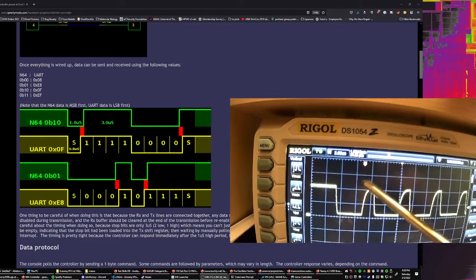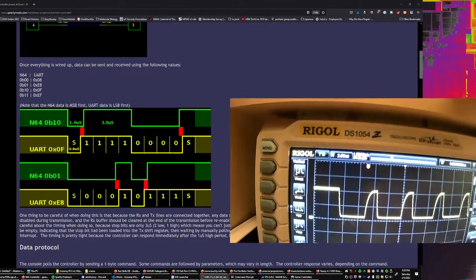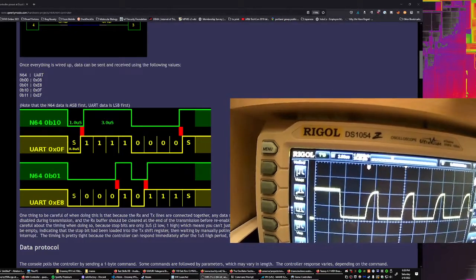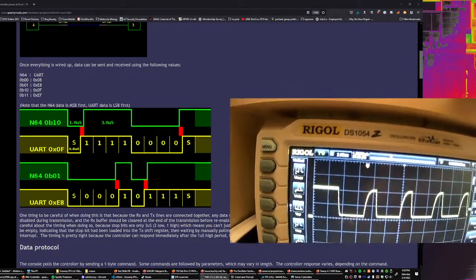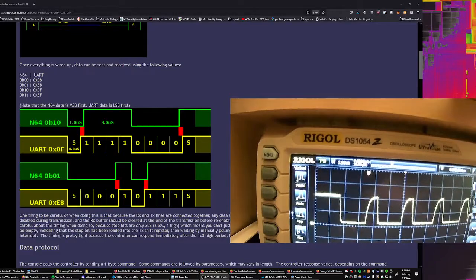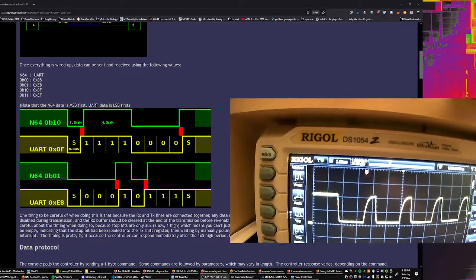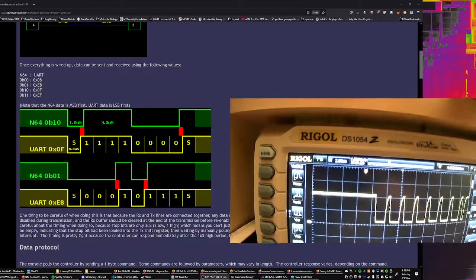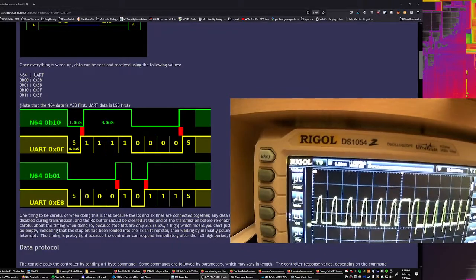that's not allowing the voltage to pass through one of the gates inside of the controller. That's one way. The other way is that there might be a bad solder connection. The cable might have too much inductance. There might be too much resistance in the wire. But what we can see is that any time you're trying to do a signal, you end up with problems when you try to understand what's going on when you have all these curves in the signal.